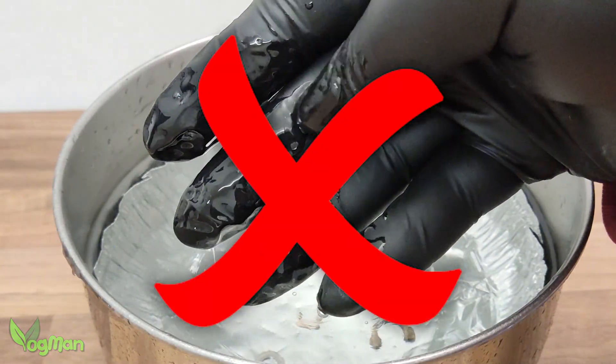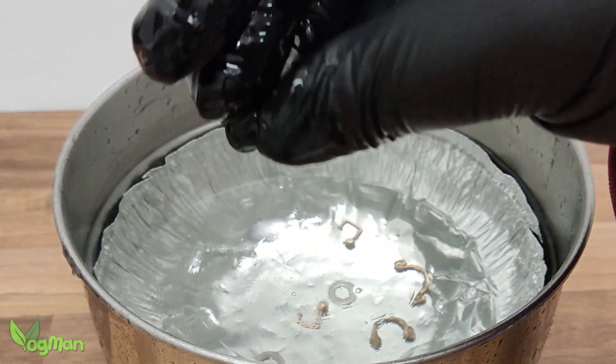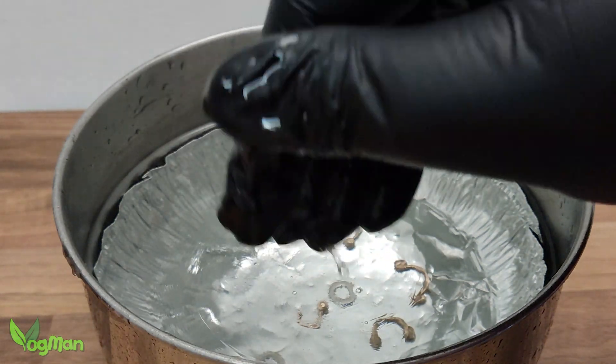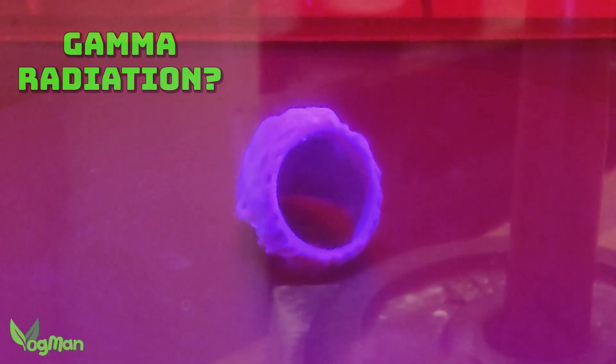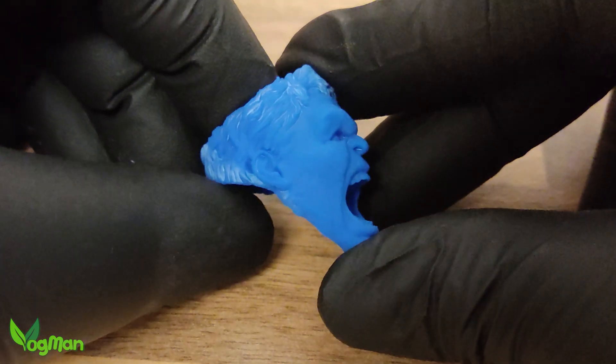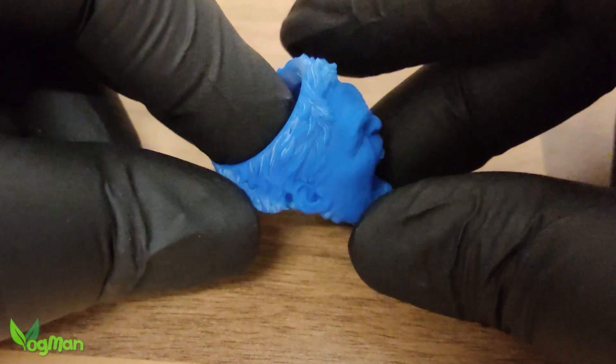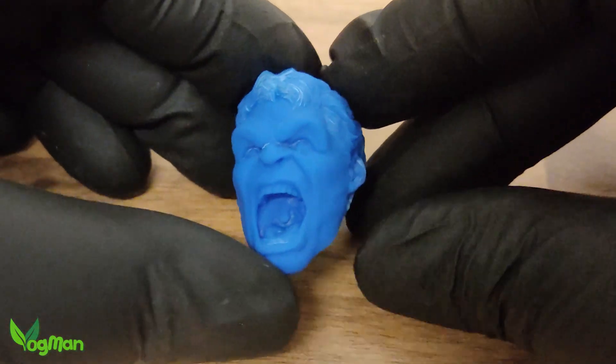Unlike Purple Cast, you'll notice that I'm not using Glycerin. From a purist viewpoint, Glycerin is actually better, but in honesty I've had no trouble curing True Blue in this way. Perhaps it's the extra wax. Once cured, check for imperfections and fill in any flaws with castable wax, then sprue as normal.